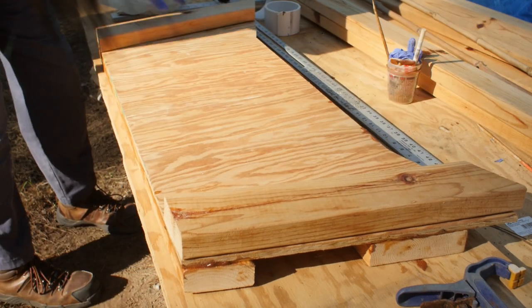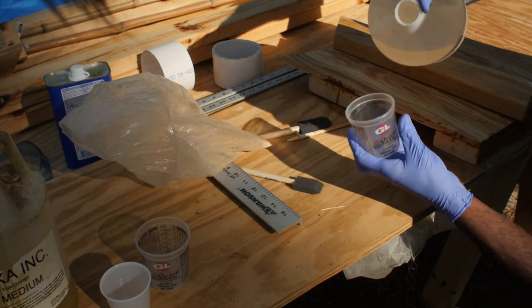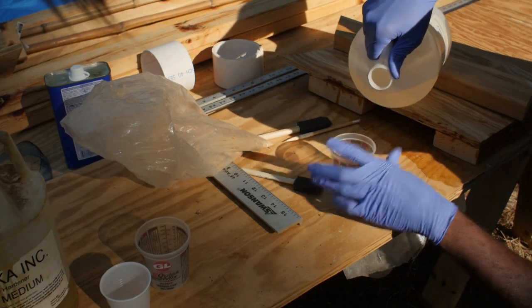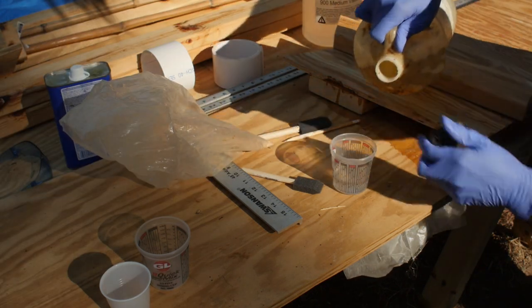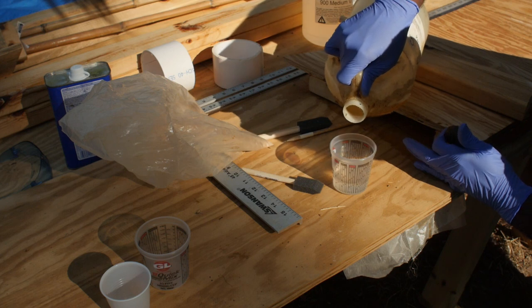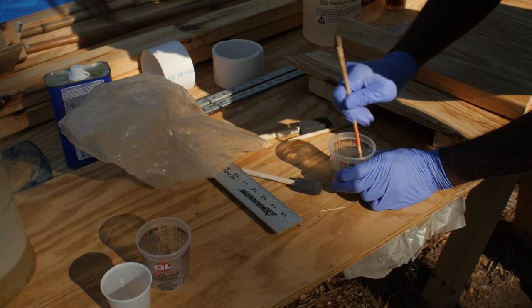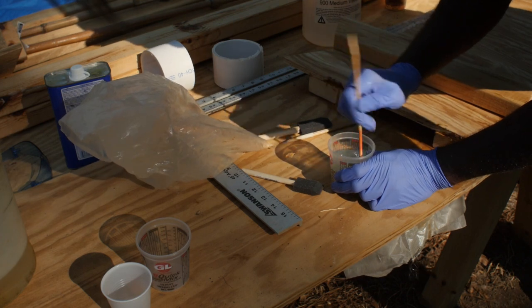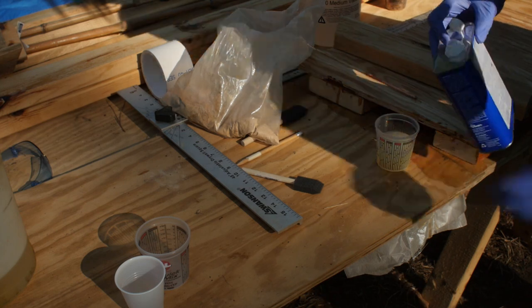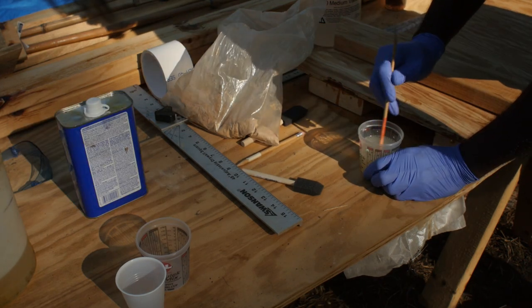Remember we're doing a two to one ratio — that's our epoxy resin and this is our hardener. It's warm out here so this stuff's already pretty loose, but I'm gonna thin it with the xylene anyway, just because. I'm putting maybe not even half an ounce — you know, hot melty honey, hot syrup, hot butter, things like that.